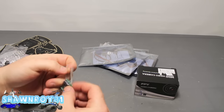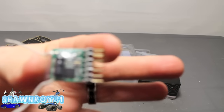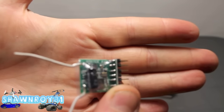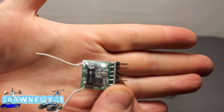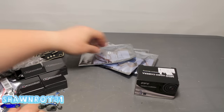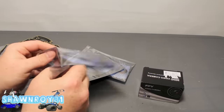We have our receiver — that's the common one that you see in a lot of my projects. These are quite cheap, I think they're under the eight dollar mark. They're the Spektrum AR6100e. I don't know what the range on them is, but I've pushed six, seven hundred feet with them easy. I'm not into the long distance stuff yet — all my FPV flights are relatively close, within a baseball field, maybe soccer or football field.